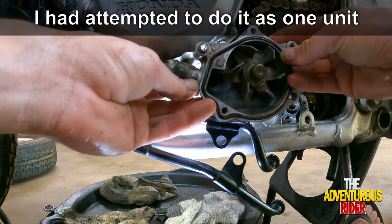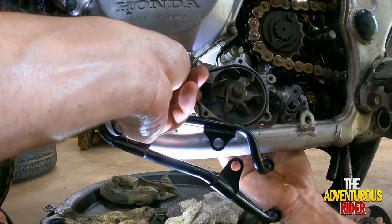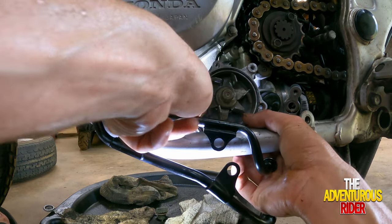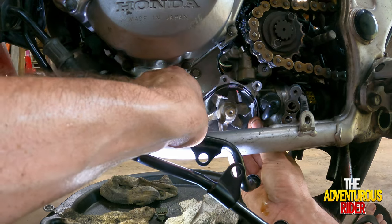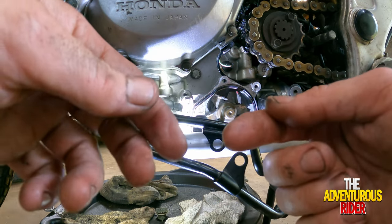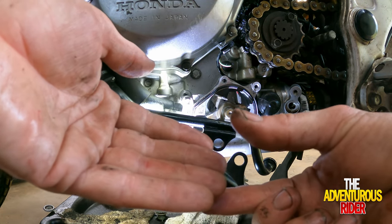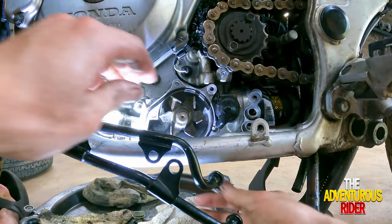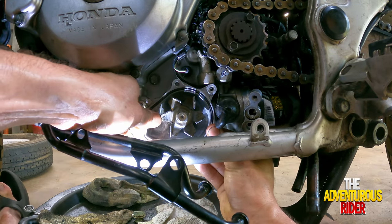Now that the front cover is back, we should be able to slide it in there without any problems — making sure we're not catching any electrical wires or hoses. Once you get to a certain point you're going to have to start turning the propeller because the back had a groove and inside the motor you have the other groove so they meet up as they're supposed to. It started going in — you can see the propeller isn't really wanting to turn, which means it's in the groove.